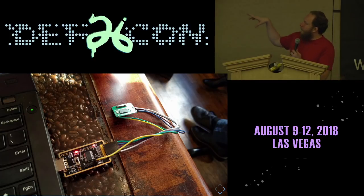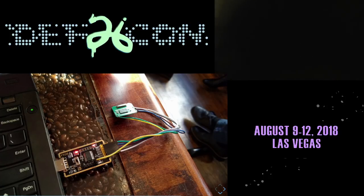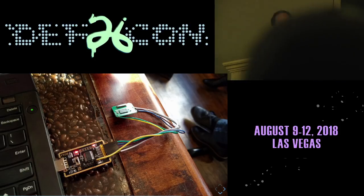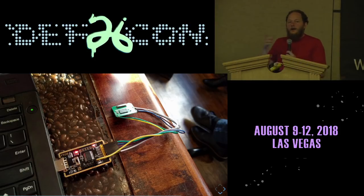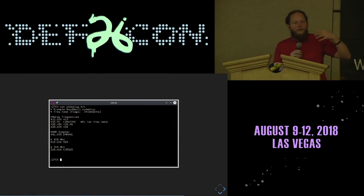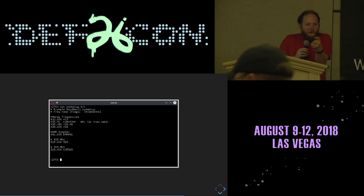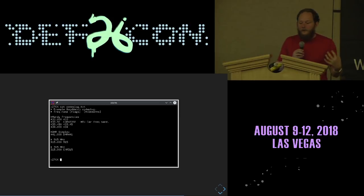For those purposes, the watch can be assembled with a built-on chip antenna outside of a wristwatch, and then all of the firmware can be communicated with over a serial port so that you can ask it to receive packets or transmit packets. And in this way, you can prototype any new protocol entirely in software as a desktop Python application without having to involve the GUI of the watch. So you don't need to push the teeny little buttons to try the thing when you're trying to get it to work for the very first time.